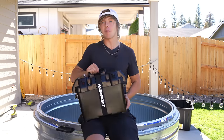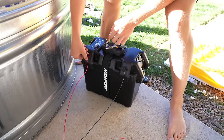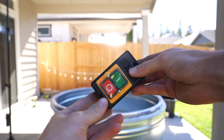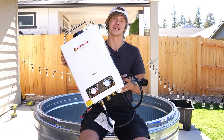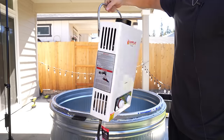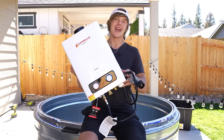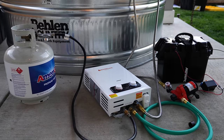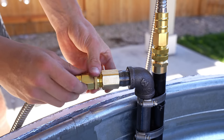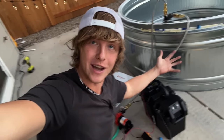The pump is powered by a 12-volt marine battery, which will also power the boat motor we'll attach later. I'm putting a switch in the circuit so we can easily turn the pump on and off. And then we have the centerpiece of the entire project — the only thing making this a hot tub and not just a cold, disappointing bath with friends. This is a propane water heater, and it's going to harness the power of a good old American cookout to make our water nice and toasty. From the heater, the water flows right back up to the inlet, and our loop is complete. And just like that, we have a working hot tub. Maybe.